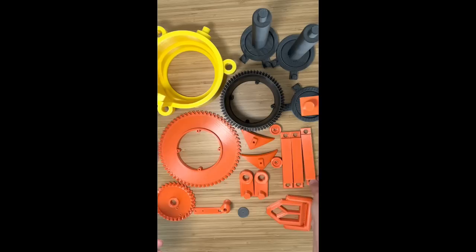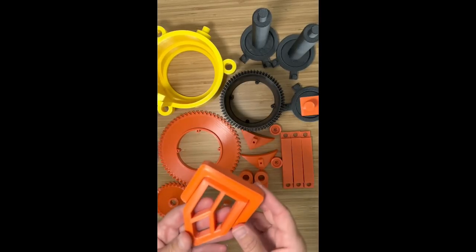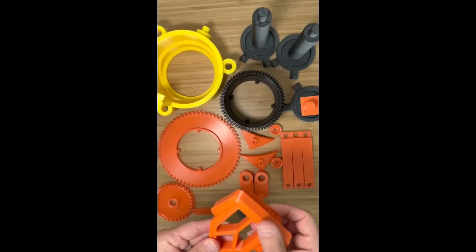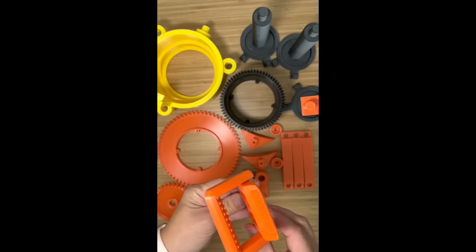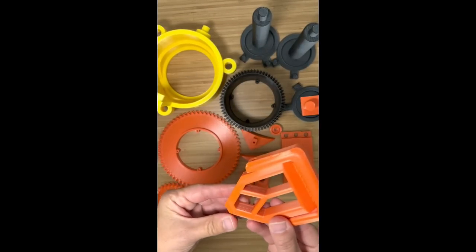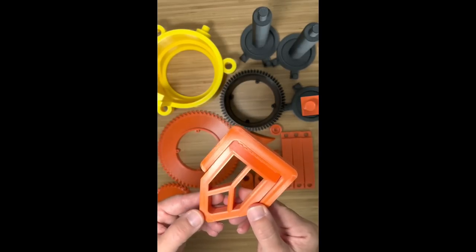And finally, the final piece that I've printed is not necessary for building the sock machine, but is very helpful for the actual knitting, and that is a clamp. It looks like this. It's printed in 2 pieces and fitted together. The clamp goes over the knitted fabric that is coming from your machine, goes through here, and allows you to firmly hold the fabric and add weight to it, which allows the stitches to be formed and also to maintain a constant gauge on your knitting.